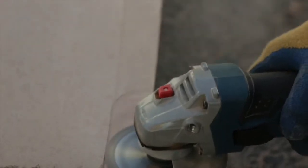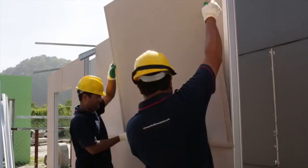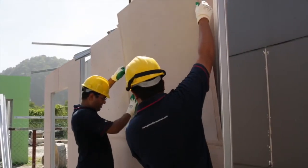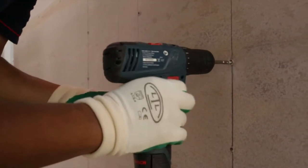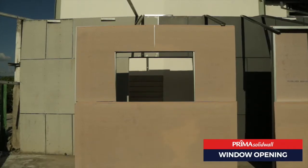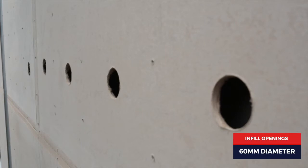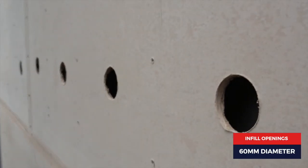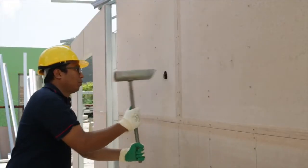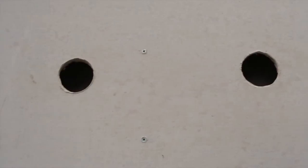Install Prima liner boards against the wall stud, followed by the second lining board. Screws are then inserted into the board against the structure. Create infill openings of 60mm diameter using a machine or manually, for every column between studs, at a recommended height of 1500mm. The wall is now ready for infilling.